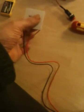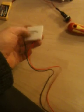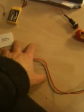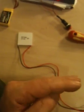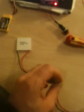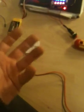And what I've done is, because remember what these do is they produce a few hundred milliamps, okay, but they produce low wattage, right? And what I need to do is I need the voltage from this to be coming out the other end at a voltage which can charge a capacitor. Okay, so supercapacitors are some 2.7 volts and some are 5.5 volts. So we need a constant voltage to do that. Now I could make a magic circuit specifically for that, but you can actually buy an off-the-shelf part which can do that. It's very small indeed.